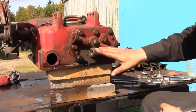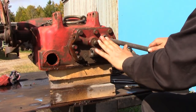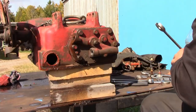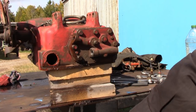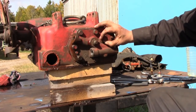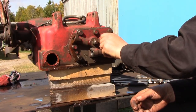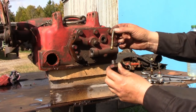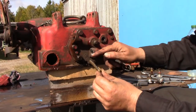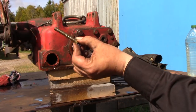On the front of the valve, right next to the piping section, there's a plug that takes a fifteen-sixteenths wrench. Behind this plug is the regulator filter. There's something you have to be careful of because they break fairly easily — it's a brass body with a screen around it, and somebody's conveniently broken this one for us already.